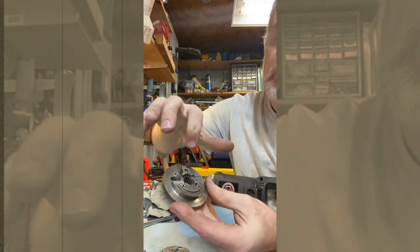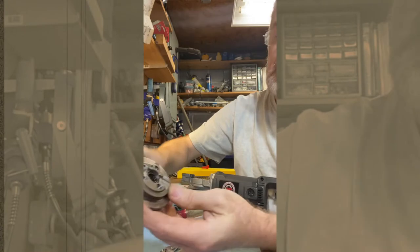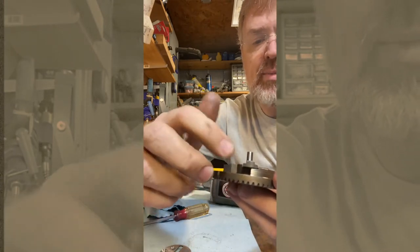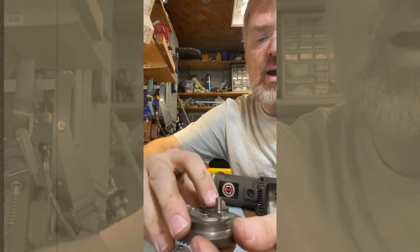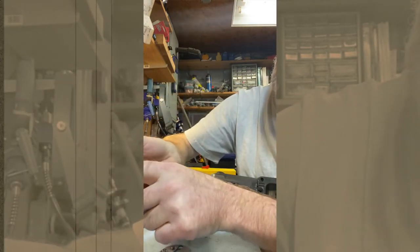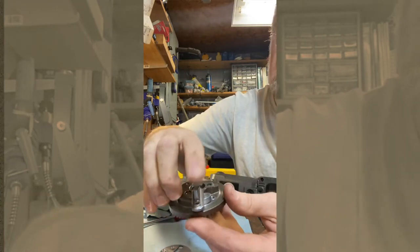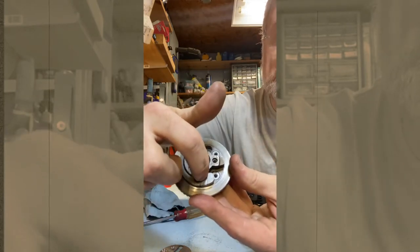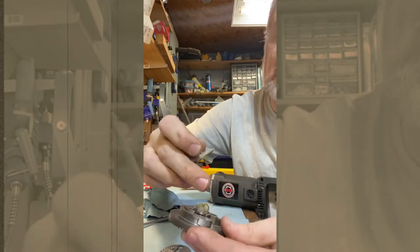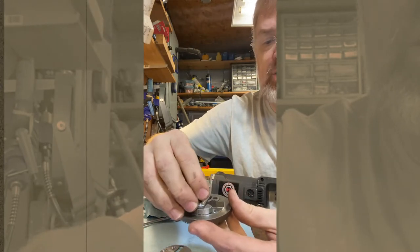So I have one, two, three attachment points. I also put two more in here with a press fit. The other issue is that as this thing slides, it's kind of hanging out in the middle of nowhere — I was concerned about that. I ended up making another piece right here and putting that in through a press fit into these pre-cut holes on the gear. That gives me some extra width for my set screw to go and press on. I decided I was going to do it on both sides, but this took me hours and hours, and I finally decided I didn't really need it on the other one.